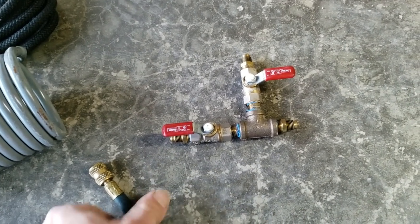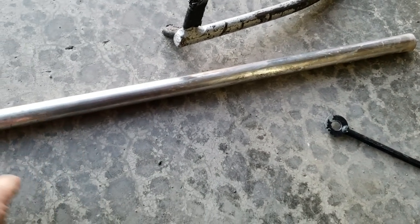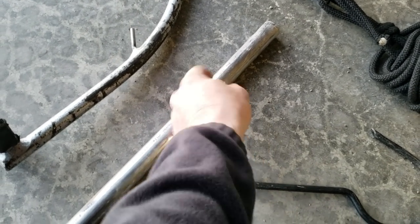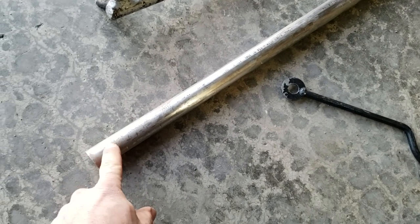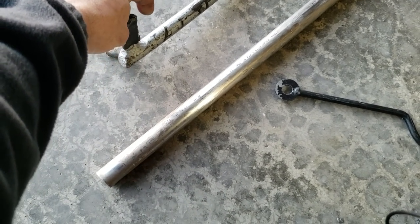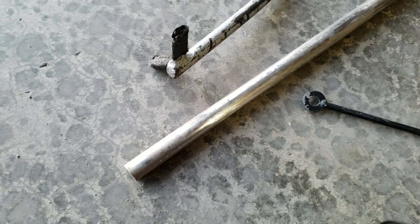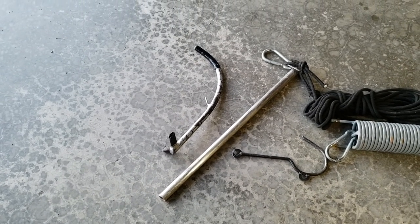My new compressor puller is going to be made out of this — I believe it's one inch diameter, hollow stainless steel tubing. I plan on cutting a 45 degree angle on both sides, welding a bead around that, smashing this side down with a hammer, getting a piece of flat stock about an inch to inch and a quarter wide, wrapping it around something round, welding a bead on both ends, and adding a little piece of rubber on both sides instead of duct tape. That generic tool is never going to get stolen, and if it does I'm out nothing.